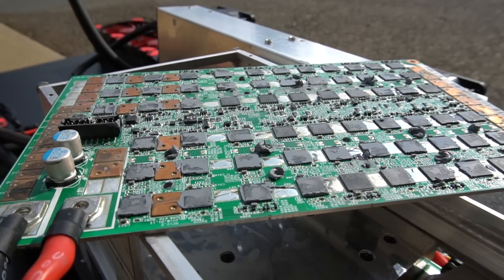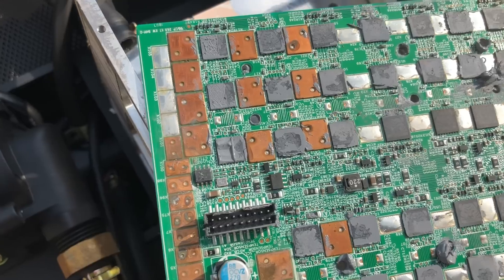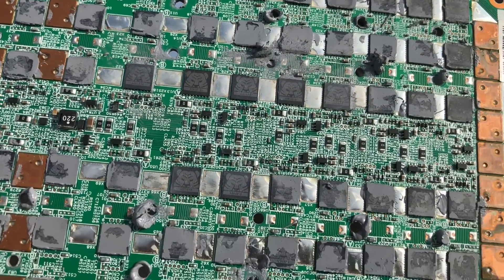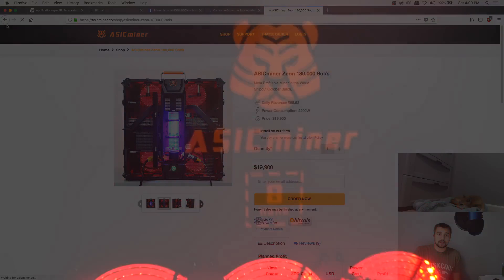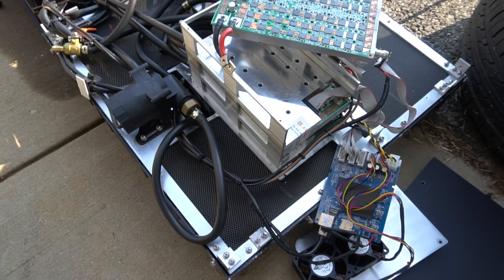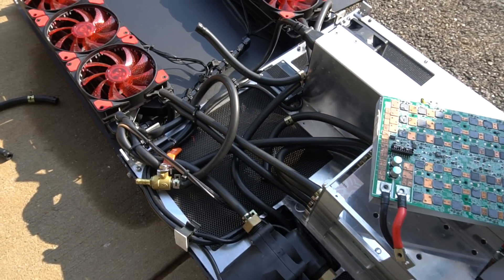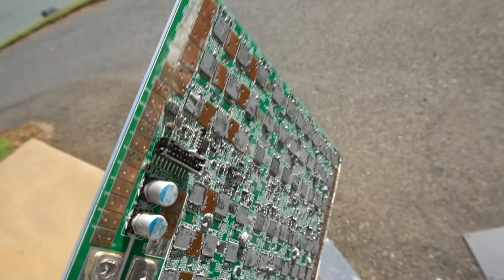If you're wondering what it looks like on the inside, here you go. As you can see, they are their branded chips - it's not like there's some other kind of miner packed in here. There are a lot of chips packed tightly together. There are three hash boards. Looking at the ASIC Miner Co Eight Nano, which we also had on hand to review - this machine had almost the exact same setup internally with three hash boards and a different labeled chip. I was unable to find anything wrong with the miner. Nothing seemed out of place. The miner did not work - it connected into their dashboard but just didn't hash, which leads me to conclude they turned it off on their end.